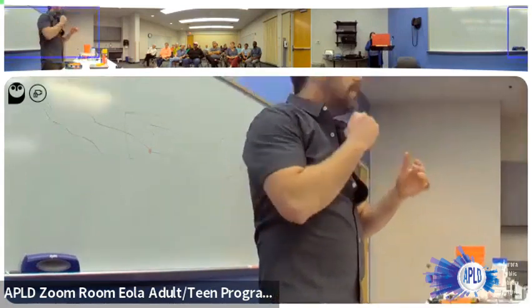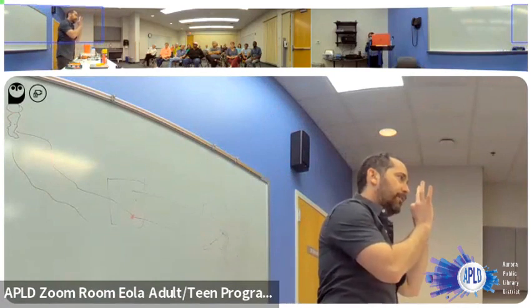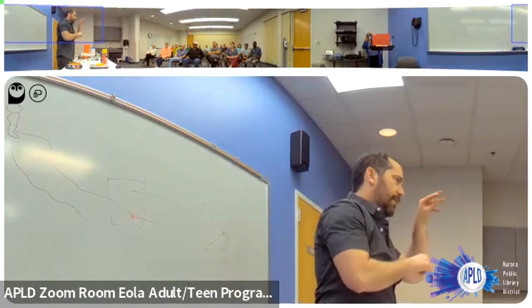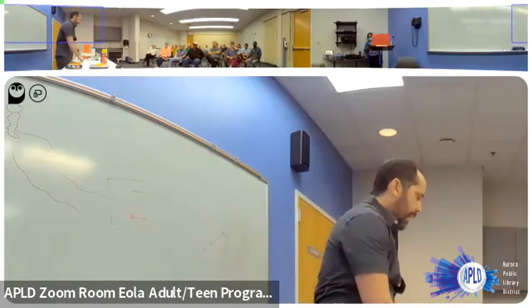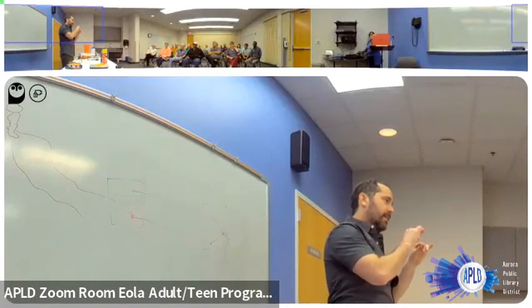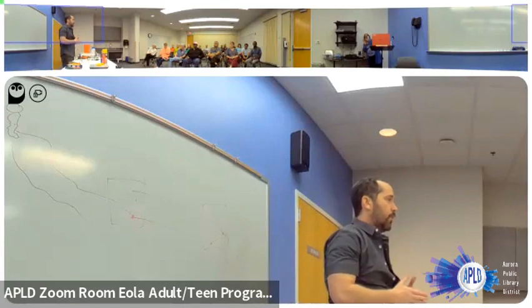And if you do have solid wiring versus stranded wiring, so the copper itself, if it's one solid piece wrapped in insulation versus all the little feathers, right? If it's feathers, if it's stranded, you've got to use this kind of device. They make little devices that you can push things in. Those are great. They take up a lot less space sometimes and can be really helpful in these old situations. But they're only for solid core wiring.